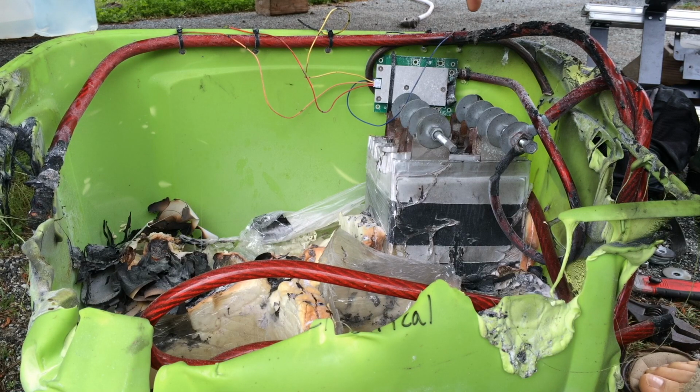Now, we also had this hooked up to everything else that was 12 volts in the RV. So if we just had the lights on, or a single light, for a period of time, eventually the voltage would drop too far, and this would have to cut it off so that we didn't destroy batteries. I've destroyed a number of these batteries by letting the voltage drop in them too much, and this will keep them from doing that. That's what these sensor wires are for.